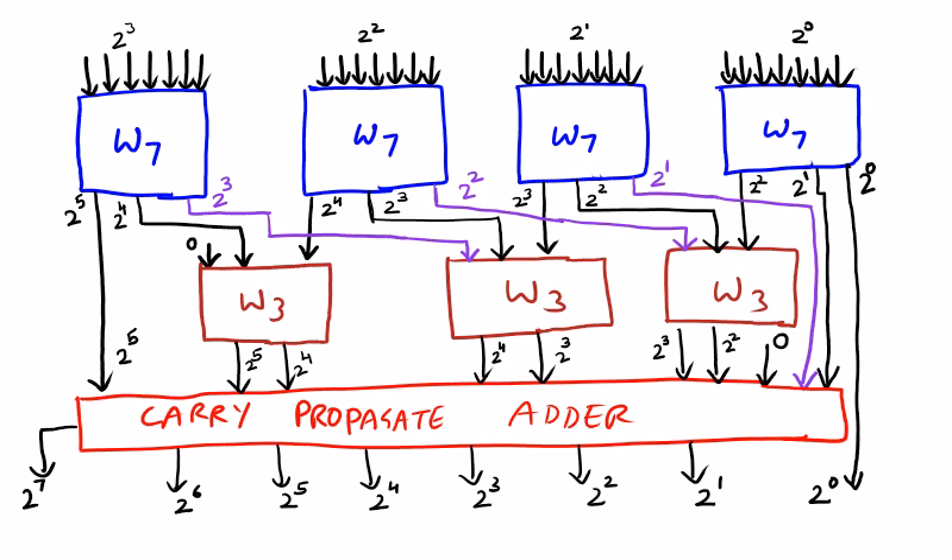Only from the carry propagate adder is the delay generated — all the carry outputs are saved. At each stage, a full adder is used as a carry save adder, so all the carry outputs are saved and then added at the final stage. The delay is only at the final stage, and thus the Wallace Tree multiplier is the fastest multiplier. However, the disadvantage of this multiplier is that the interconnection between stages becomes highly irregular when the width of the operand increases.